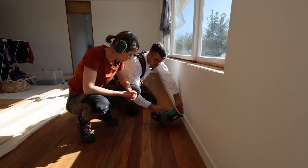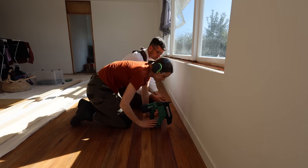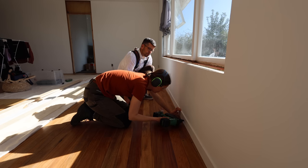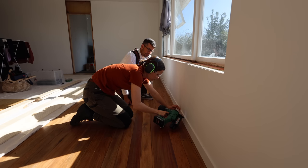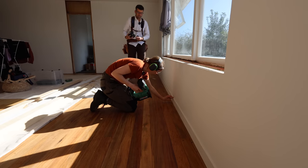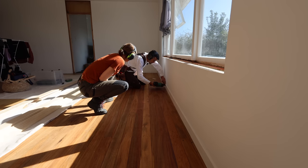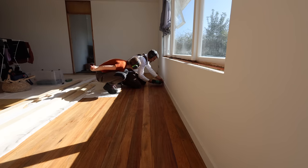Put two shots and then turn it around the other angle and go a third shot. I like to put an angle on it so it doesn't just pull out — so it's hard to pull out. You just want to push it down so it's hard to the ground as you go, and make sure you use your left hand to push it down. I want to get you to do the rest. I just feel like I'm going to do it wrong. No no, you're doing a good job. It was Finishing Carpentry TV where I learned that — nail it in on an angle. Why again? It just helps it grab better — it's not going to pull out as easily. Shout out to Richard. Well, he knows finishing carpentry — I mean, it's in the name.